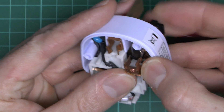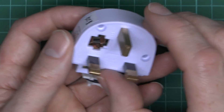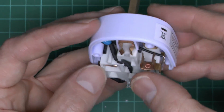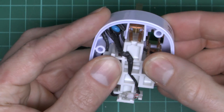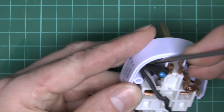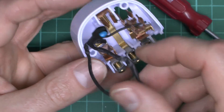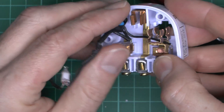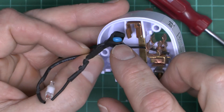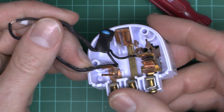The 13A fuse applies to both the thing connected to the wiring and also the socket on the back. One potential problem is that if you wanted to connect something not requiring a 13A fuse — such as a lamp — you can't, because any fuse you put in here, such as a 3A fuse, means whatever you plug in the front is also on that same 3A fuse. So that's certainly not ideal. Now let's see what we've got in terms of alleged surge protection — certainly not a lot. Just a spacer to allow things to line up, the little neon indicator, and basically the line and neutral connections, with a little wire tacked on going over to what looks like a MOV — a metal oxide varistor — and then of course the neon which turns on when the thing is powered. So yes, not a whole pile of stuff.